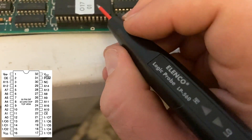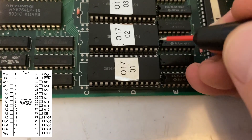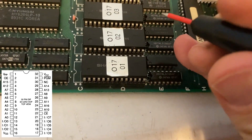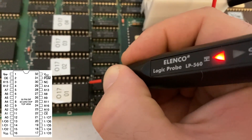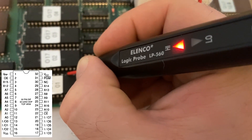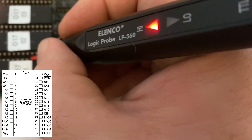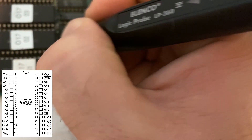Basically the address lines are getting set calling for data, and then the output lines send the data out. Now let's check the other side, because what could be happening is if it isn't receiving a chip enable signal. Output enable won't be used on this chip because that's part of the two extra rows not being used, but it will use the chip enable — the CE line — and that needs to be enabled for the chip to show output. Output three is holding high. Same thing on output four, output five, output six, output seven. And the chip enable — CE with a line over it, meaning active low — that is showing low, so it's enabled all the time. So this chip should be showing plenty of output.